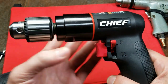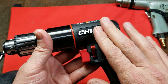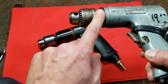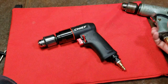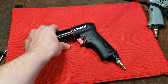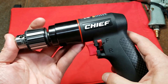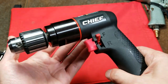Various message board posts talk about gearbox rebuilds needed and vanes wearing out in the air motor. The gears are also wearing out, whereas on older front-exhaust tools you don't have as much gear wear because they're constantly getting fresh oil and the air blows small particles of wear out. Those small particles act as abrasives, and the point of the air tool is that it's supposed to be very heavy duty and last a long time — that's been the point of air tools for decades.